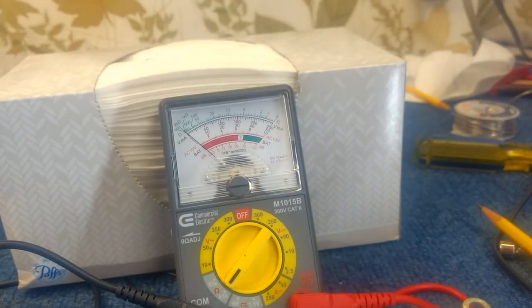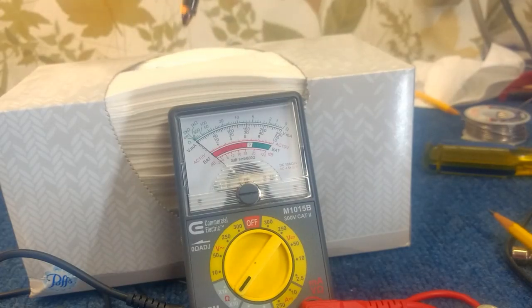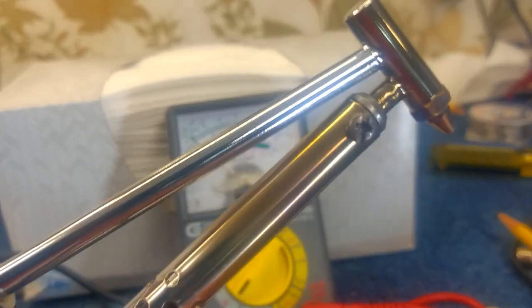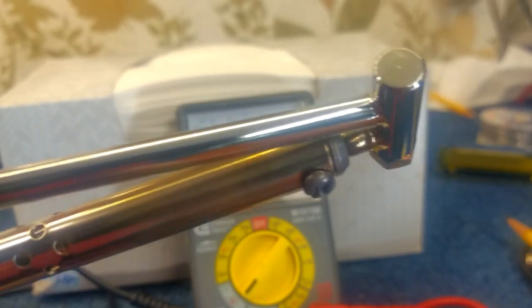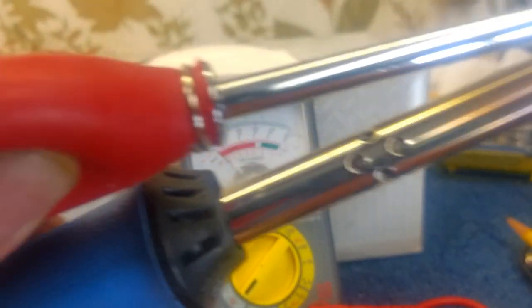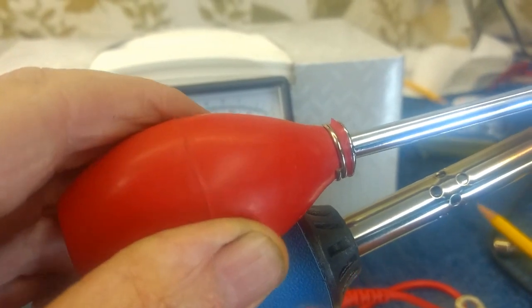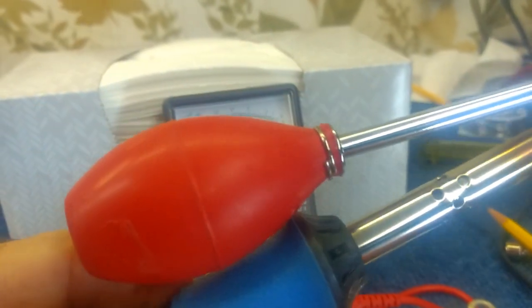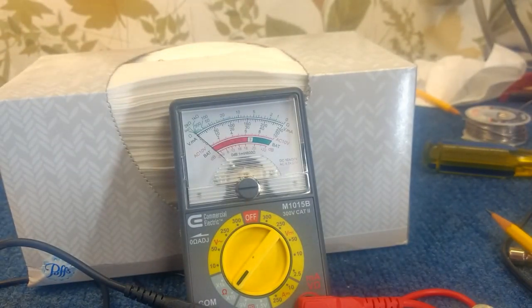If you can walk and chew gum, you can squeeze this. Do it like this to blow out any solder laying in there. Then when you're ready, get everything lined up — you can put the board in a vise or something to hold it. When you're ready, squeeze the tube, apply the hot tip to the board, and then suddenly let go of the tube. Don't do it slowly — you don't create enough air current. Suddenly — a sudden jolt of suction will pull the solder into the tip for you to later blow off.